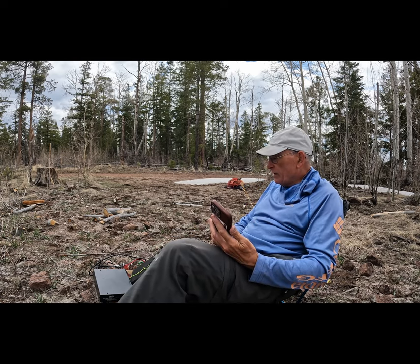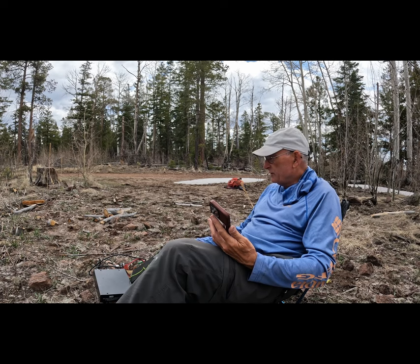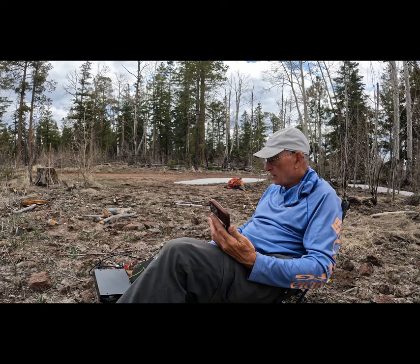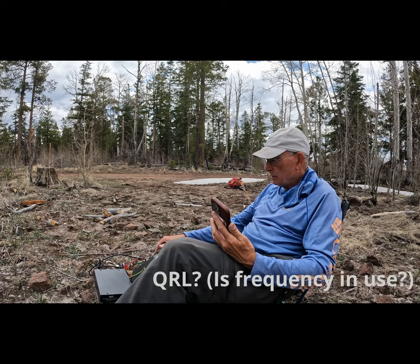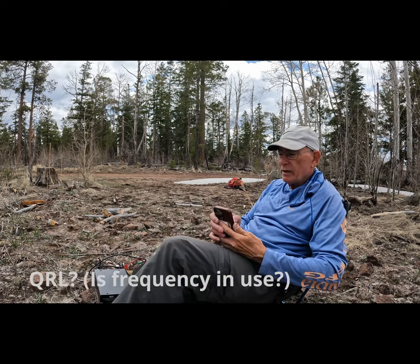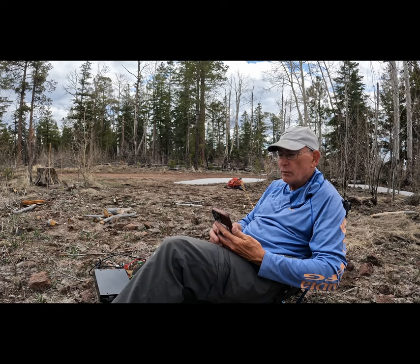And there's our keyer working. Uh-oh. We may be too close to digital. Let me move down a little bit to 28054. We'll tune one more time just to make sure we're dialed in here. And SWR is flat. All right, we're good. We're gonna get on the air here at 28.054.